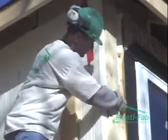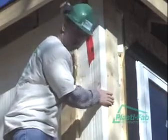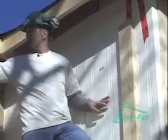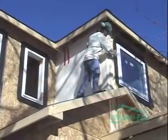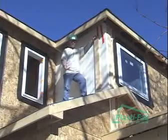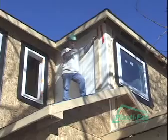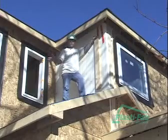This way they build it out — the OSB is going to run through, and they'll paper or Tyvek this wall. The nice thing about this is you now have a six-inch concrete core for fire separation separating this unit, which is adjacent to the next unit. Because of the sound ratings and fire ratings you get from a six-inch concrete wall, it makes this a very usable space for two units — it's more like living in a single-family home versus a duplex.